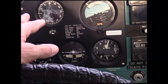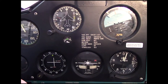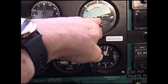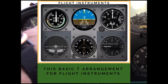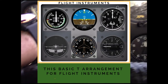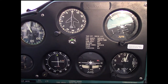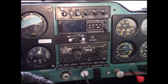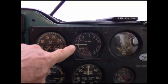That's the flight instruments. In later years, into the late 50s and early 60s, they came up with what's called the basic T — to standardize all aircraft so you could transition from one airplane to the next without retraining your eye scan. The basic T has the attitude indicator in the middle since it's the most important, airspeed to the left, altitude just to the right, and the gyro compass below. This 1956 configuration is not set up in the basic T. In the next video we're going to talk about the engine instruments.